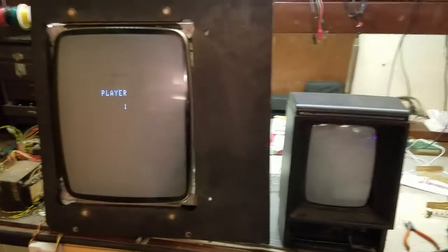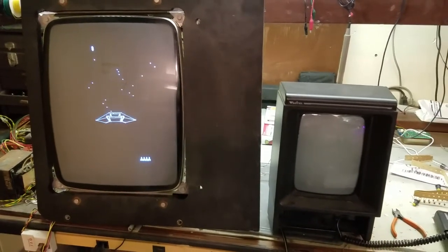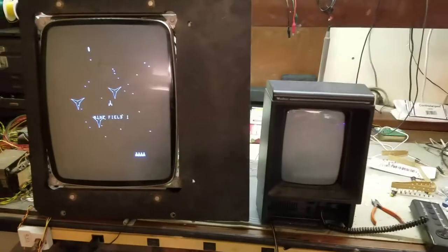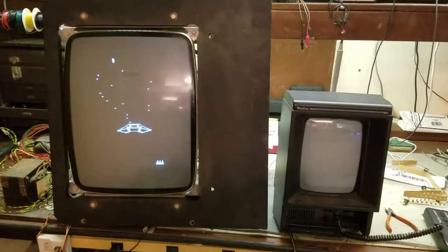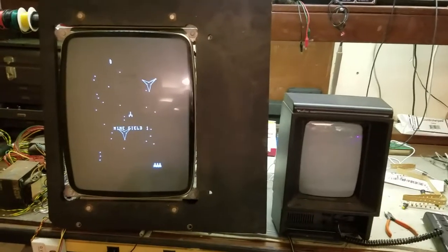I'm going to go ahead and try an even larger capacitor — something like a 0.0082 microfarad. I have more than enough adjustment on my potentiometers to fix the screen. Even right now the linearity looks good and the picture looks quite good — it's completely playable, I could leave it just like this. But now I'm getting into that tweaky, fiddly phase.